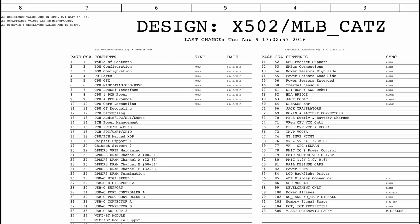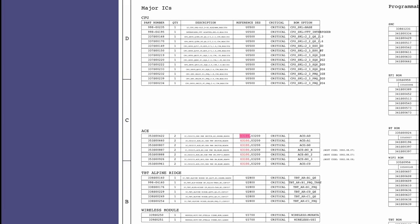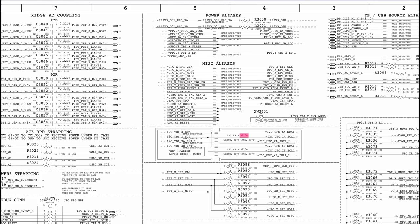I'm going to use a 3-year-old version of FlexBoardView to show you exactly what I mean on the screen in the schematic right now. We're going to go through and show you precisely why we know that we have a particular power rail as a result of us getting 20 volts. So on this machine, the charger is going to speak to a charge controller chip. Take a look over here. Where do we go? So this here is a charging controller chip.